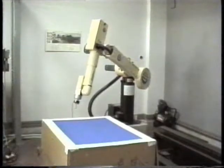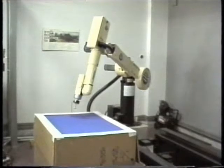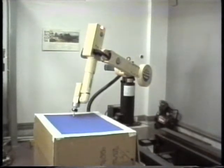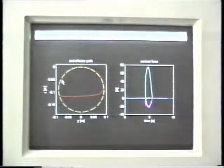The open-loop force control feature of impedance control can be tested when the end effector comes into contact with a cardboard box. The box is placed in such a way as to obstruct the commanded path. It can be recognized that full path tracking is achieved during unconstrained motion while a compliant behavior is ensured during constrained motion. This is confirmed by the recorded data. The time history of the contact force clearly shows how impedance control well reacts to the unexpected presence of the environment.